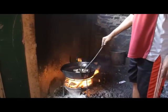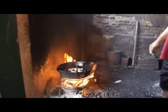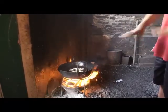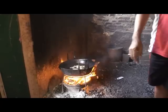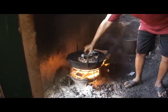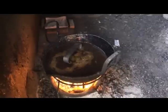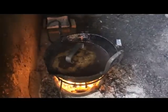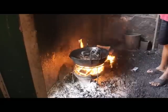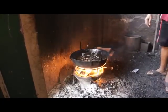Once all the elements are in place, the stamp is dipped into a solution made up of melted tree lacquer called telanban. The lacquer is boiled in a metal pot over a wood fire. The stamps are put into the metal pot and allowed to soak for about 20 to 30 minutes, then allowed to dry and polished. After this process, the lacquer holds the thin metal strips together and does not allow them to move when the stamps are pressed onto the fabric.